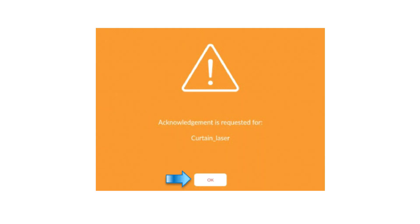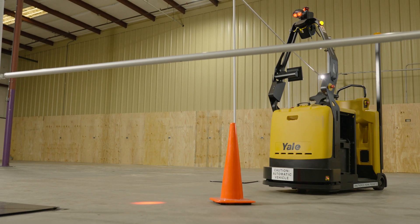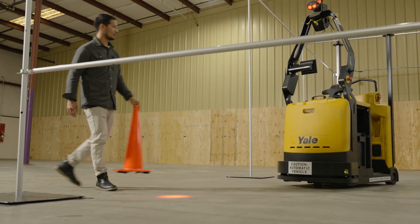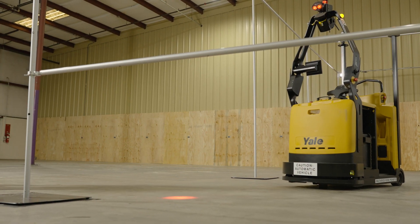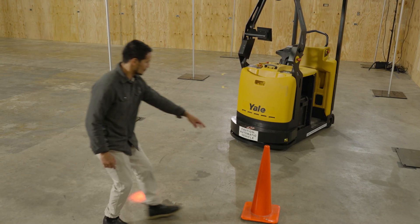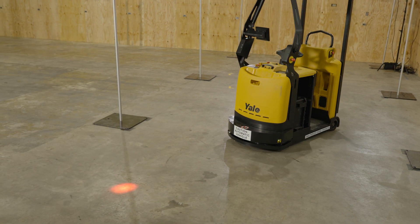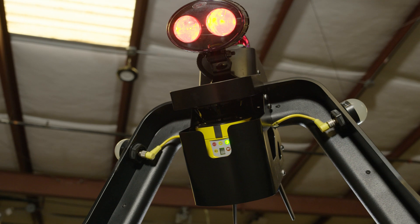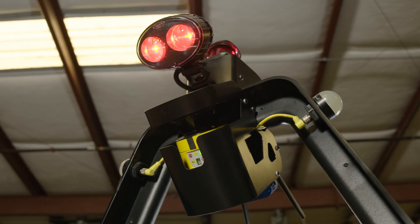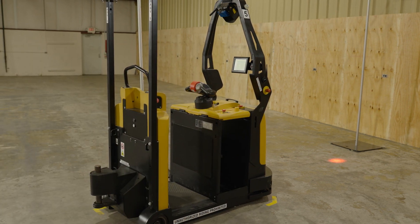An orange safety screen with explanations is displayed. After detection of an obstacle, the robot stops and emits audible and visual warning signals. To resume automated operation, remove the obstacle and ensure that there are no obstacles near the robot. Press OK on the touch screen and leave the robot travel path. The main screen is displayed again and the robot continues its mission. During the first seconds after pressing the button, monitoring by the curtain scanner is disabled to allow the operator time to leave the monitored field. Do not remain in front of the robot.